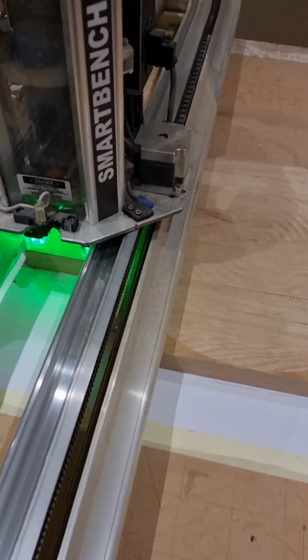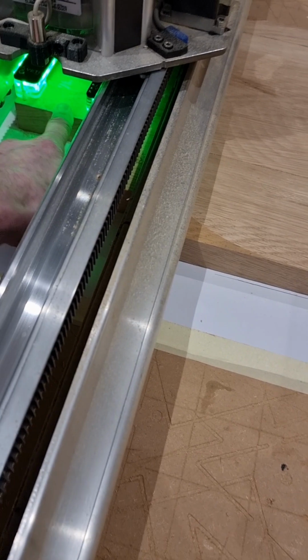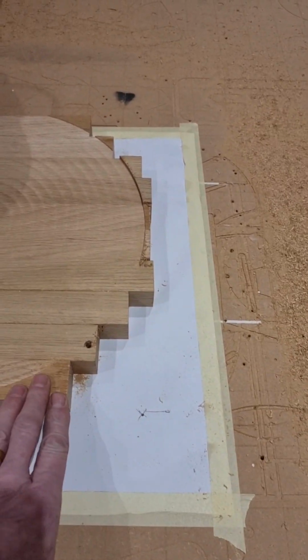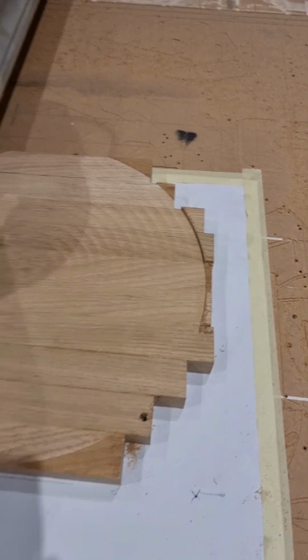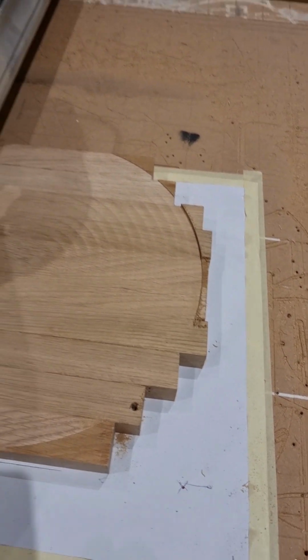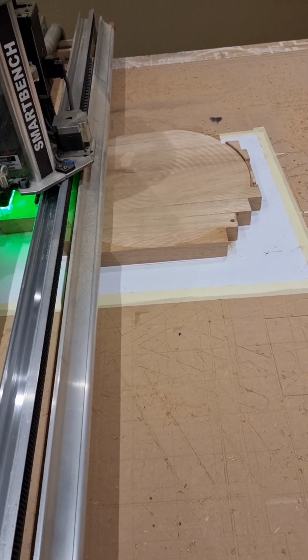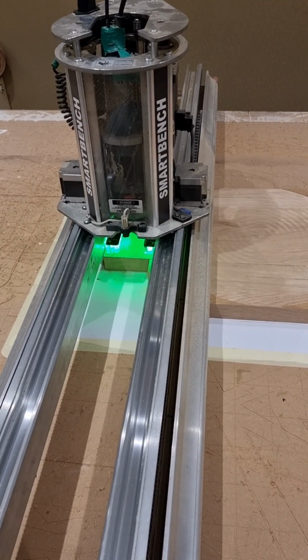Okay, to get past that little glitch, just set the Z height back to one of the old bits of board that haven't been cut yet. So I need my old heights. I'm going to do a couple of passes to get it back down to the 3mm, and then I'll take one more clearance pass over the whole lot, and we should be good to go. So there we go. See, no one can be perfect.